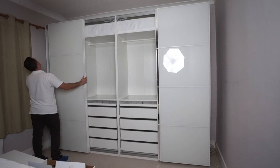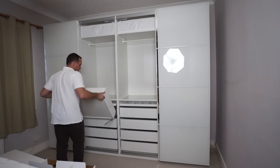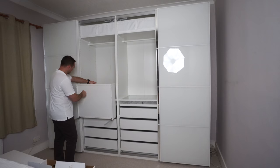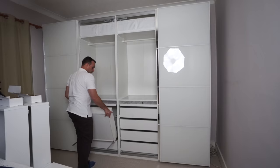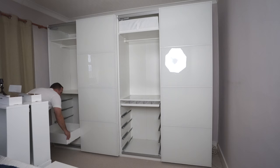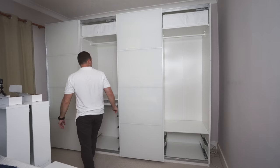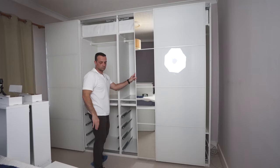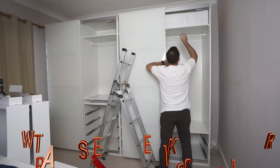Before doing the adjustment on the hinges, note those brackets are missing. Once you take those plastics out and put them back in, you'll wear the hole and it loses its purpose. Remove all the drawers and all the interiors from the wardrobe before you start to fix the doors, so you have access to everything. It's important to do the frames correctly — connect them properly, make sure you're using all the nails and everything in the box.